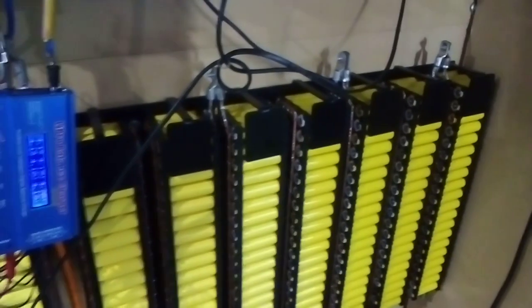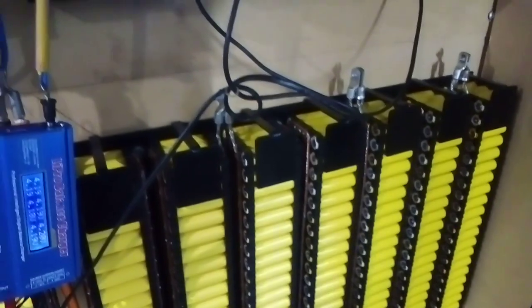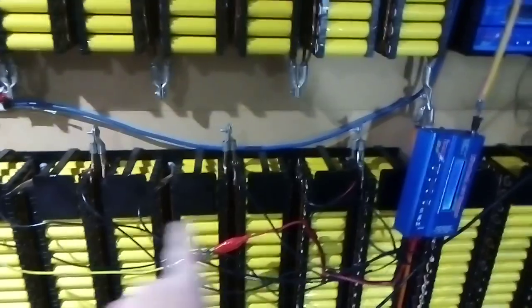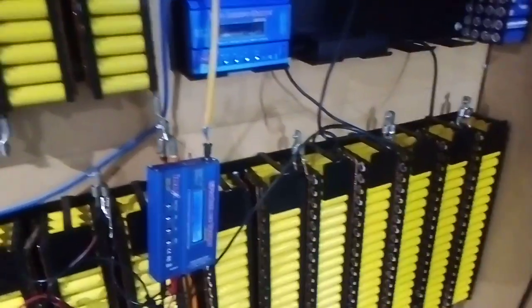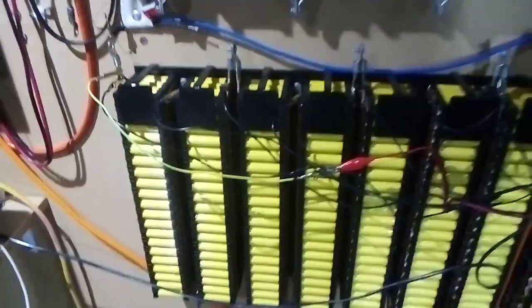What might happen is, between those two packs, I'm going to run them in parallel — the first seven to the second seven — while I'm on 24 volt. I would think this set will drift more out of balance than the other one, so I'm balancing them at the top end, and hopefully they'll stay balanced.